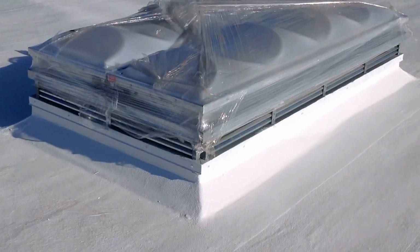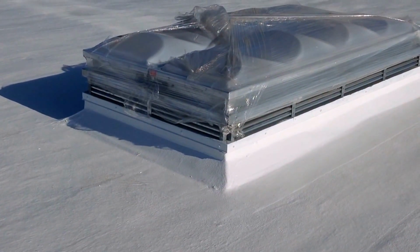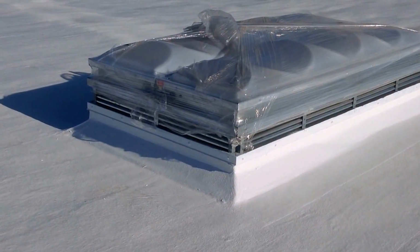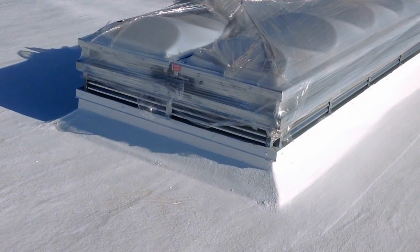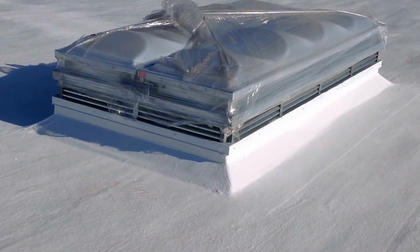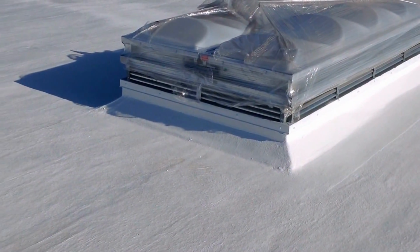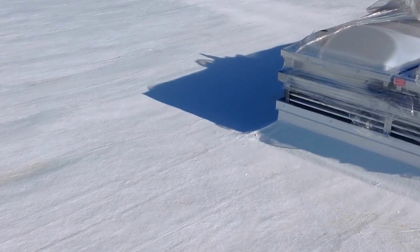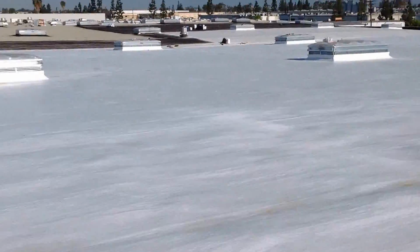These are all new skylights that have been installed. What was here was smaller skylights, 6-footers, and they cut those out because they wanted the 4x8s put in. So they cut into the foam. These are curb mounted. The other ones were self-flashing. So they built up the area around where they cut out with foam, flashed it, and then put our two-ply system right onto the curb.